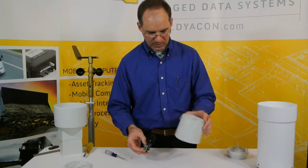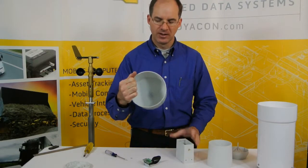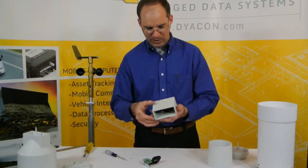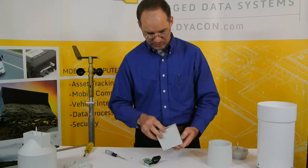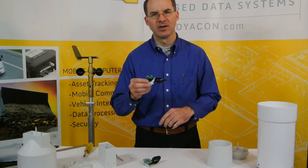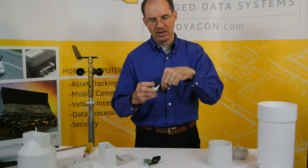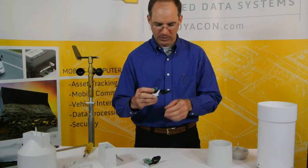The problem we've had with this one — it comes in a number of configurations. We bought two of them. This one has a much larger orifice, similar in size, about six inches, to the higher end rain gauge. However, the same issue applies as with the smaller one: the single spoon is very prone to being overwhelmed by the flood of water during high precipitation rates. As the water is dripping in while it's tipping, that tends to hold the spoon down longer, losing even more measurement accuracy.